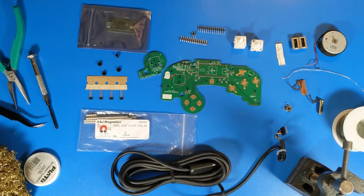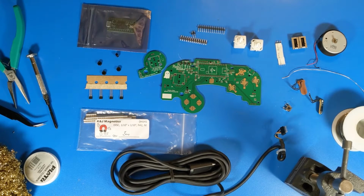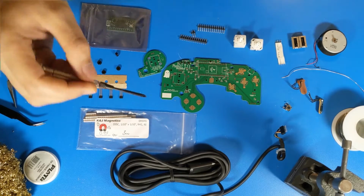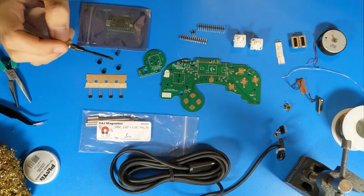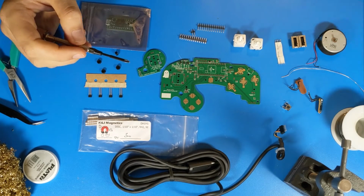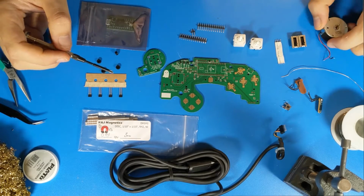This is a demonstration video for assembling a PhobGCC 1.2. This is a prototype board 1.2.1, while many of you watching will be building 1.2.2s. Many of the steps will be completely identical, but there are small differences. 1.2.2 has slightly adjusted footprints for the D-pad, for optional buttons, which sit on the D-pad and make inputs more reliable. 1.2.2 also moves the rumble bracket attachment in order to not pinch the wires.